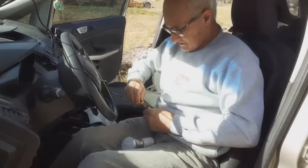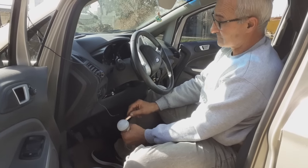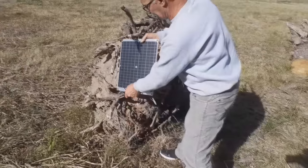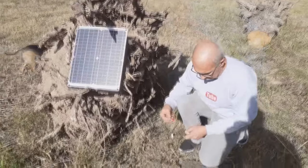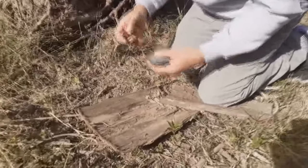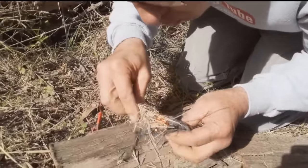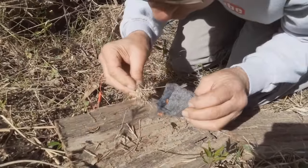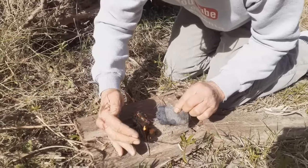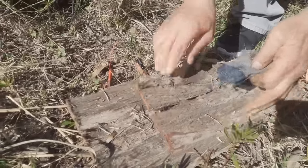Now we are going to turn on a 12-volt 7-watt LED light directly with the solar panel. Watch how it turns on and off. Now the ultimate test — directly with the solar cell. I'm going to get some fine steel wool and put it on this pad. We connect one end to one pole and touch it with the other pole. We blow on it and it automatically ignites, because the tiny strands become incandescent due to the short circuit. And with it we can light grass on fire — believe it or not, but it's only with the solar cell itself.